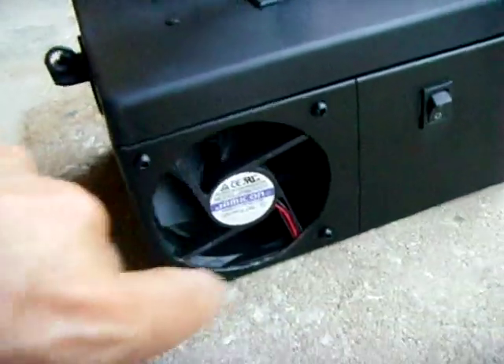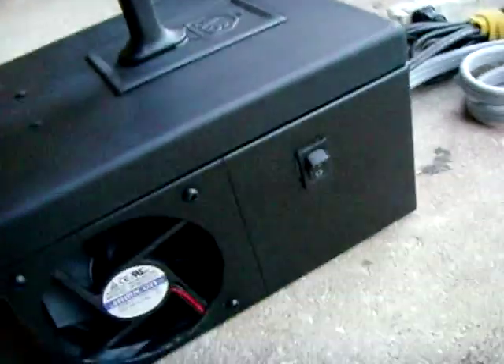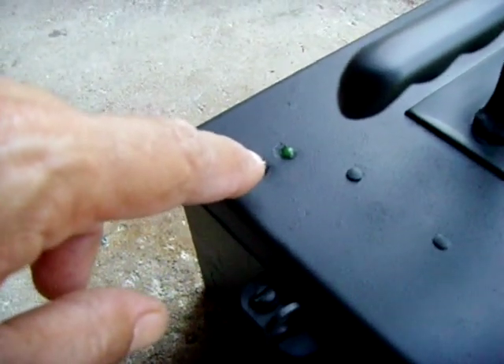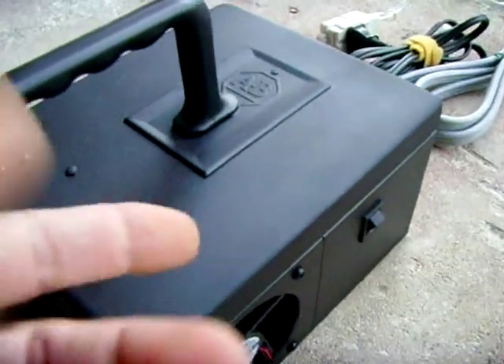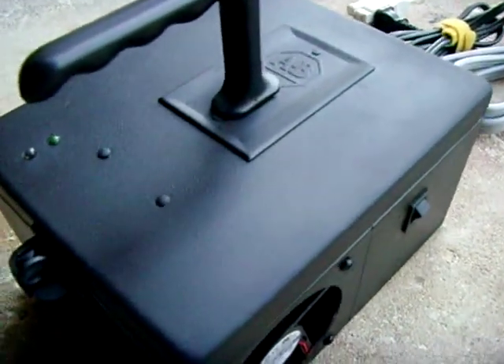I mounted a small box fan, put an on-off switch. Over here is a power indicator — a red LED that comes on to let you know there's power to the transformer. There's also an internal fuse. I put a 10-amp fuse, but it doesn't draw 10 — it draws about 6 amps. Got a lot of current.